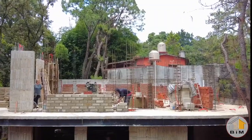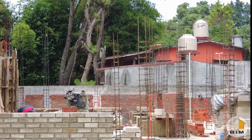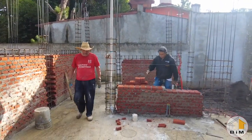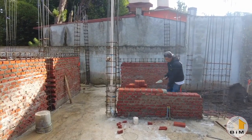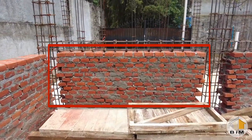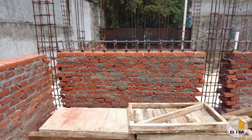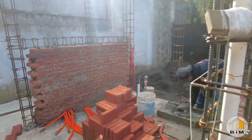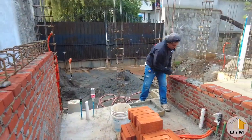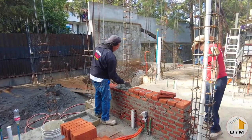We're going to be constructing the walls on this floor out of cement blocks and brick, primarily brick. And there's a method of constructing brick walls in which they build these rectangles of brick that are surrounded by upright and horizontal rebar and concrete structures. On short walls, such as they're working on here in the back section of the house, they'll construct a single section of brick that has an upright concrete and rebar post on each end of it.